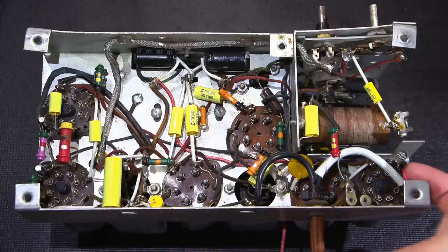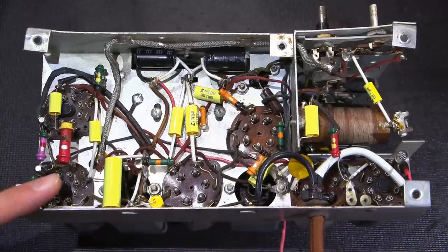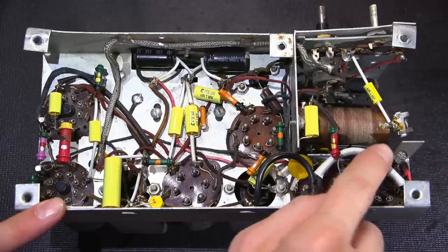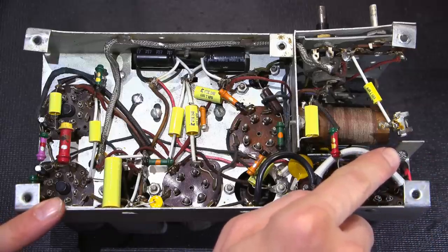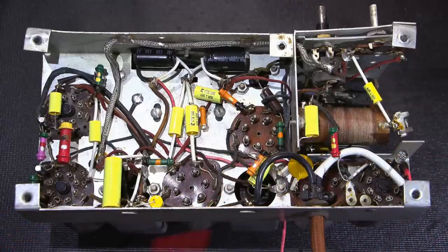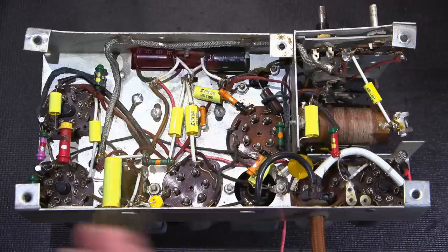There's a strain relief right here. You can see if I move the cord around, it moves a little bit. Well, I don't want that to tug on this fuse. So this is a 1.5 amp fuse that's in line with the rest of the radio. I call this an absolute value fuse. This isn't supposed to go away unless something really goes wrong with the radio. So it's